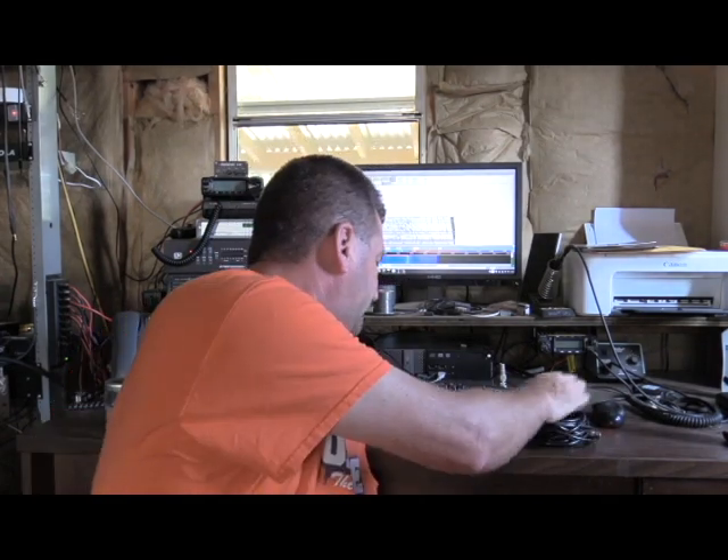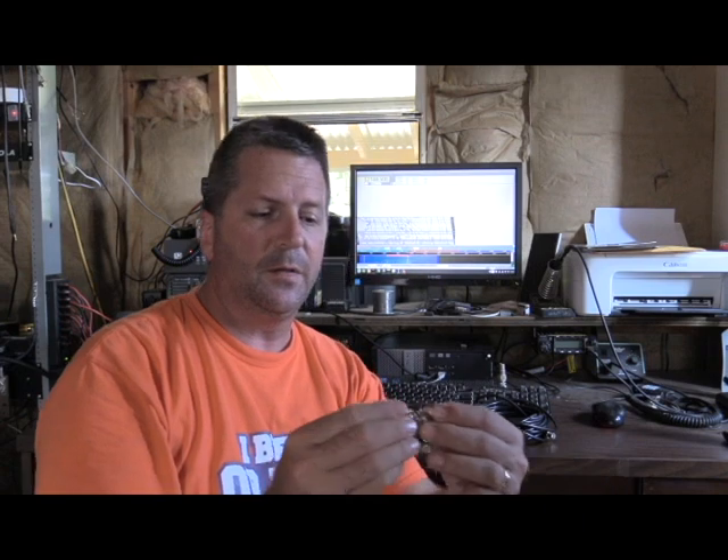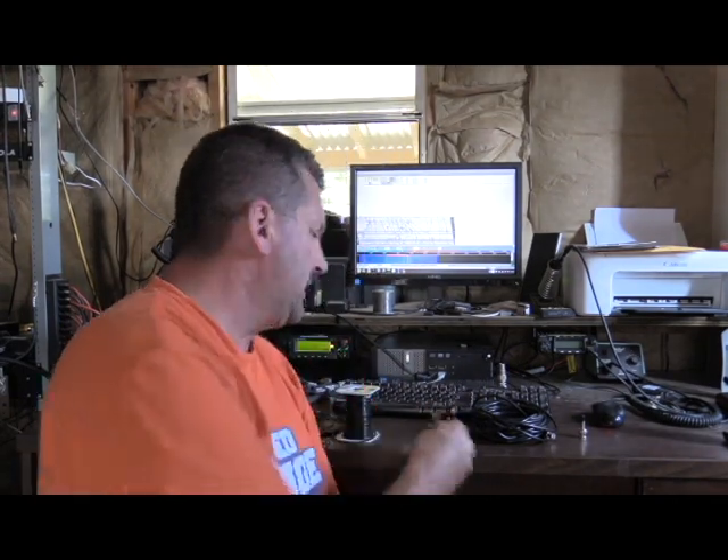Your antenna also needs to include, for the parts list I'm going to give you, a BNC male on one end and a BNC female on the other end. That's important because the components of our antenna system are going to match up with each of those. You're also going to need the proper adapter for your radio — you'll remove the factory antenna from your handheld radio, screw the adapter on top, and connect your coax into it. BNC connectors are quick quarter-turn connects and work out just fine. Buy a couple — these things will run from you in the woods.